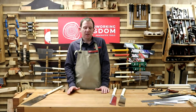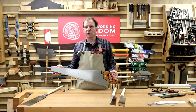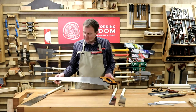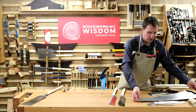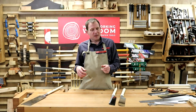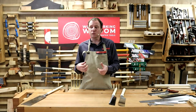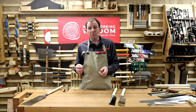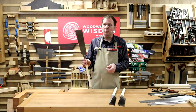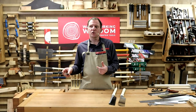You can. A normal handsaw, we could sharpen that. Craig used to do this by hand. I've hand-sharpened handsaws years ago. Now, Japanese saws, which we haven't got to yet, think how the blades are constructed, they will need sharpening a lot less. To give you a comparison, for a Western panel saw, if it's resharpenable, and good quality ones are, you'll pay good money for them. But you would have to sharpen that 7 or 8 times in comparison to your Japanese saw, because the teeth are harder on these, so they're going to last longer. So you sharpen it less.